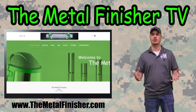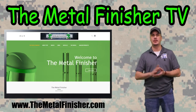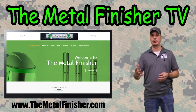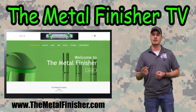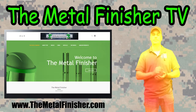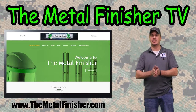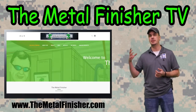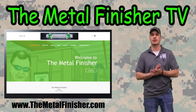Now let's talk about suction blasting systems. You'll need a suction gun with an air jet used to siphon abrasive through the hose. This process is slower and less pronounced. Some pros of suction are lower upfront cost, lower operating cost, and it uses half of the air of a pressure unit. Most automated systems you'll see are suction because they are continuous — we don't have time to stop and replenish the pot with media, we just want to keep going until we're done with all of our parts.